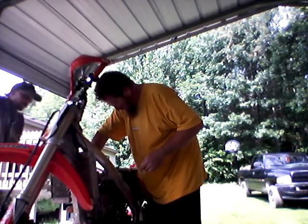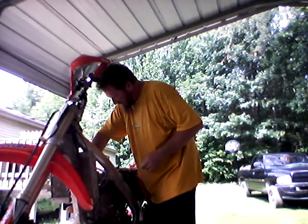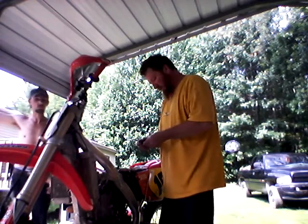Okay, this side's a 6. I can tell you that right now. One side's tighter. Right there at 6, it's plus or minus 1. That side's basically in spec, but if I'm taking it off, I'd shim it to a 4.